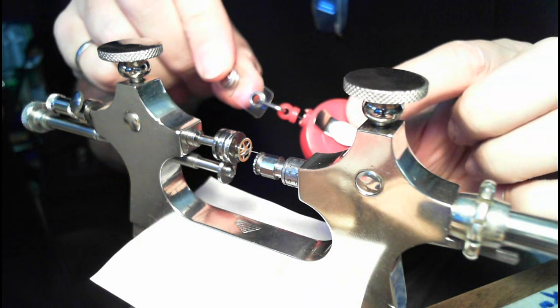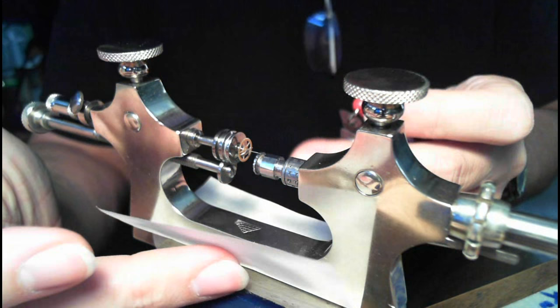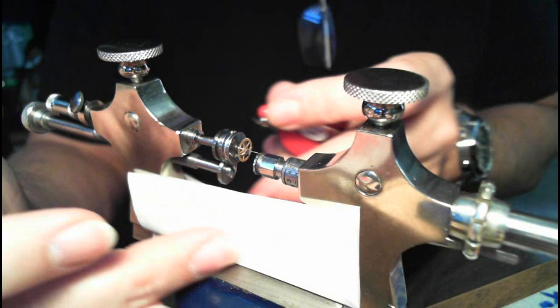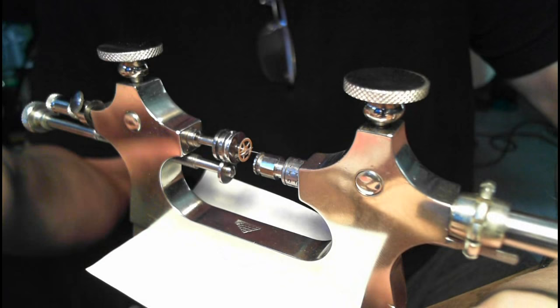And then all I did was, I've got a vise down below and I've got the watch paper jammed in here. And they also said just put the Jacot tool into the vise and put the watch paper on the sides. That way when you drop parts down the middle, the paper catches the part. Then you've got to jam this thing just on the edge like this, so the string is free like that.